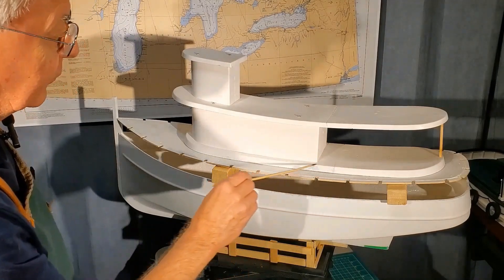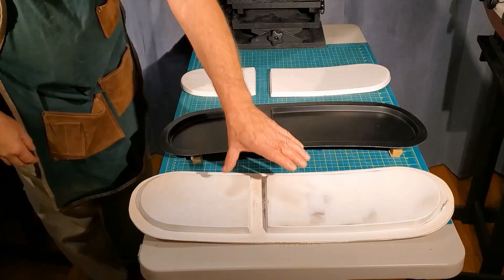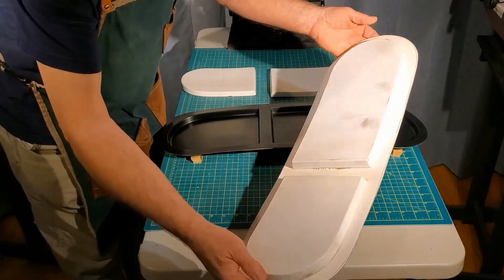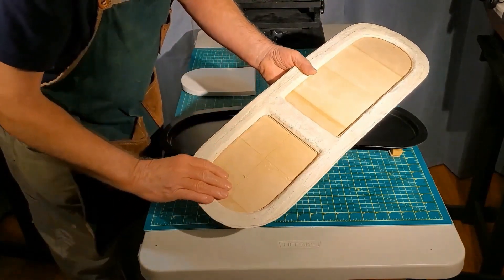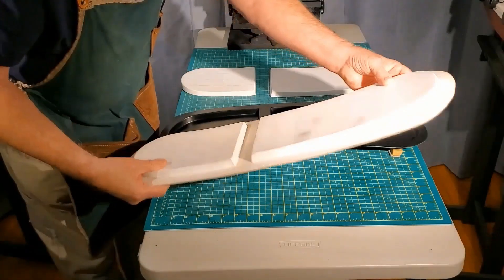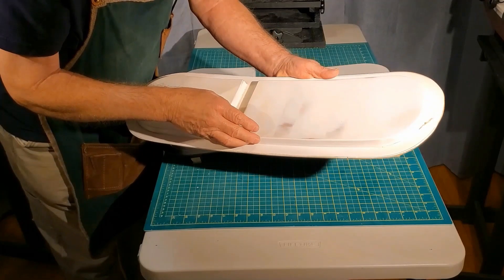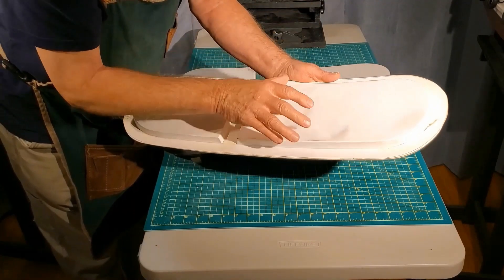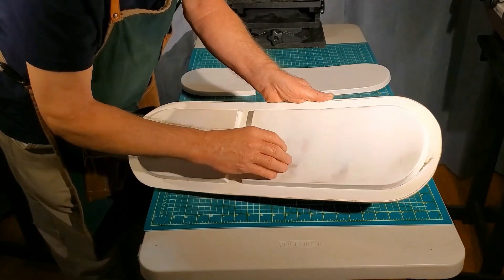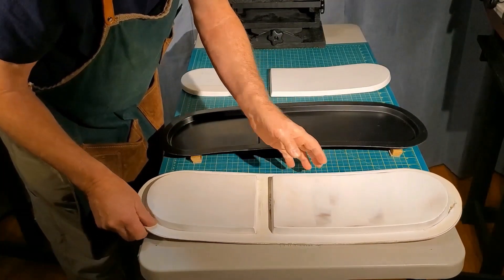Let's take a look at these fiberglass hatches. The hatches fit over the deck openings and are a slightly loose fit. Here's the hatch plug, the hatch mold, and two hatches. In order to make the hatch plug, I first fabricated a deck out of fiberglass using my deck mold. Then I filled in the area around the opening with basswood. On the top, I expanded the combing on the original hatch opening about one eighth of an inch, which accounts for the thickness of the layup of the hatch plus a little bit of space. After the wood structure was in place, I used fiberglass resin, gel coat, and epoxy filler and got everything nice and smooth. Then I waxed it all up and took a mold off using the same method.